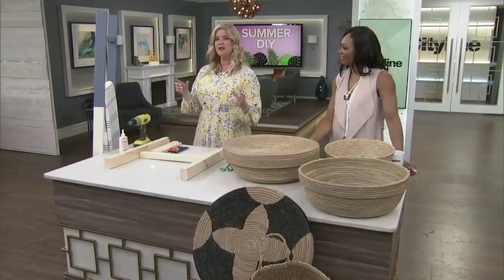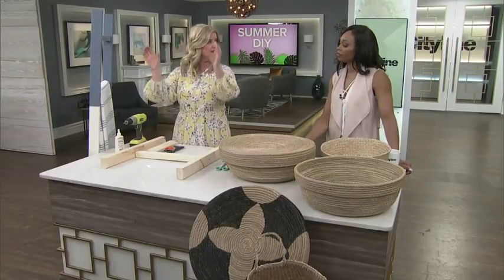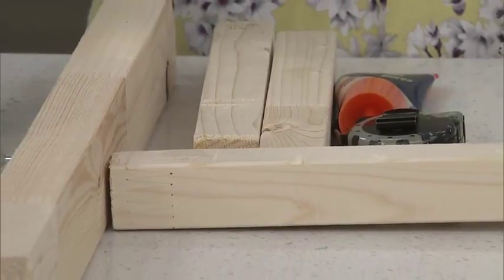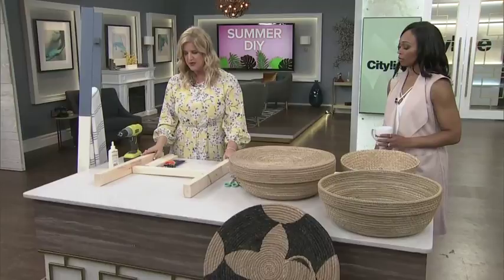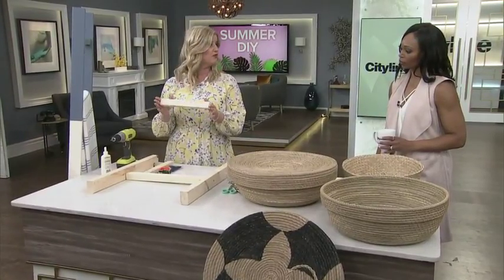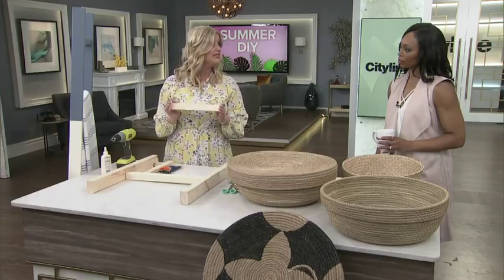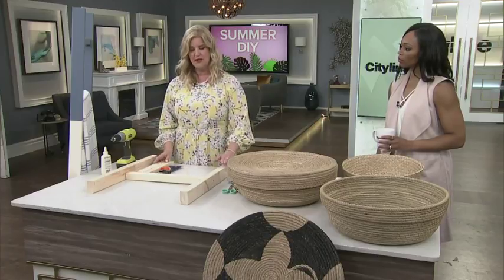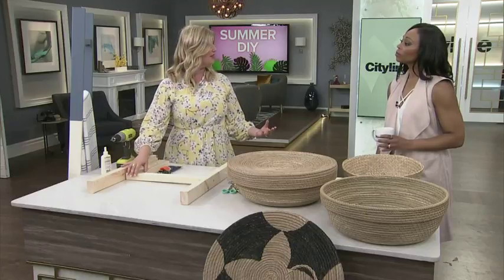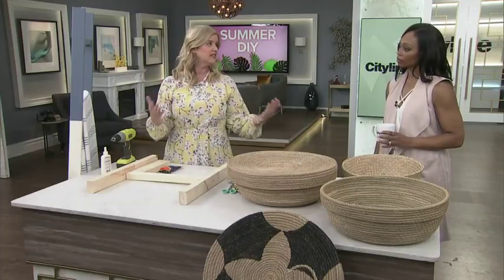There are a few different options of wood depths you can use to build this. I went with two-by-three pieces for the sides, and I had them cut at six feet because you're going to angle it on the wall, so you want it to have lots of height in the room. And then I went with two-by-twos for the rungs across the middle. If you want to stain it, you'll have to spend a bit more money because inexpensive lumber often has manufacturer stamps you'd have to sand off. So painting is the budget-friendly option.